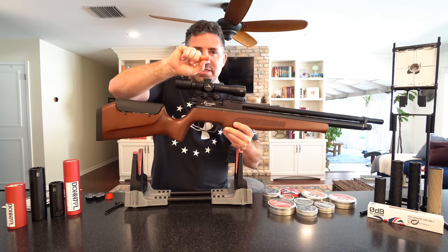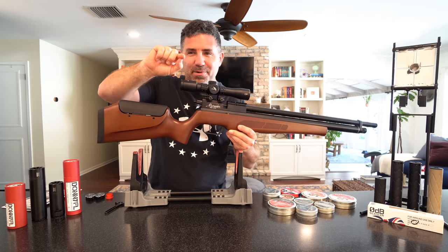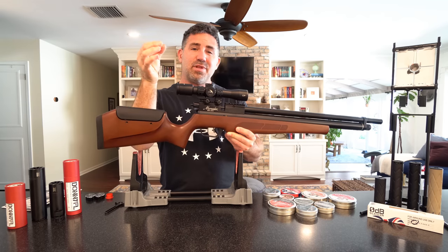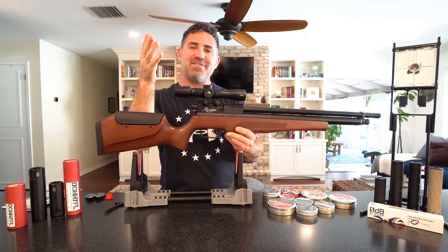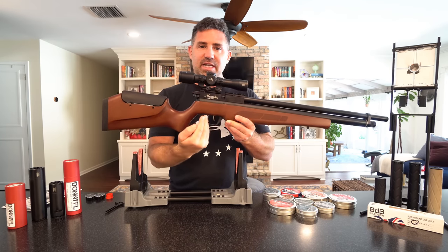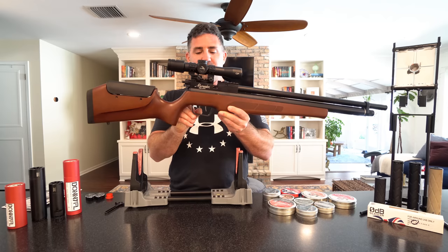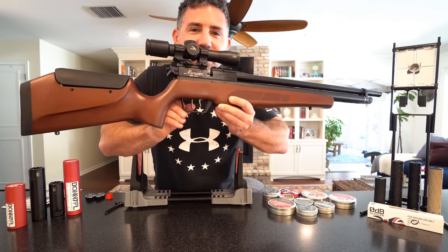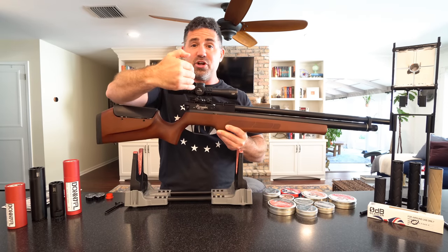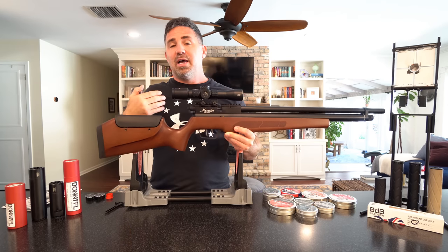All right. What that made for was a minuscule first stage of about a millimeter, and then a half inch of pull, pull, pull, and then boom, it went off. By lightly completely seating that screw, about a turn and a half clockwise, I was able to shift that first, second stage relationship to where the first stage was more like that. So a very good, recognizable first stage. It lengthened that by about a third, and it took about a third out of that long second stage pull before it broke. I liked it much better.